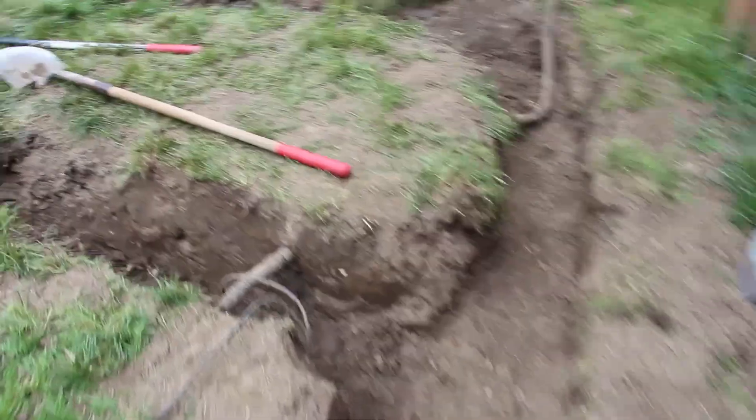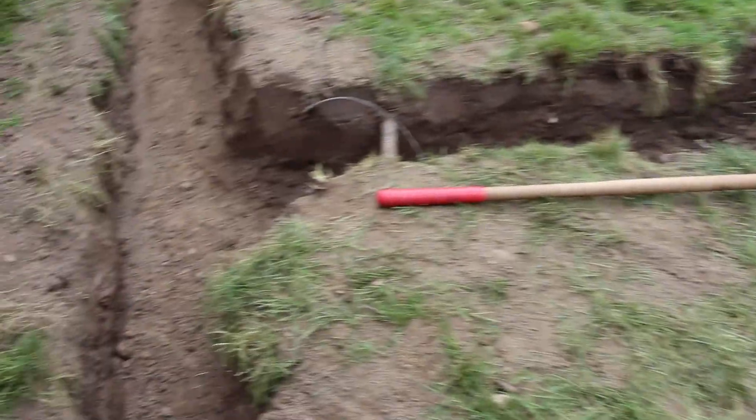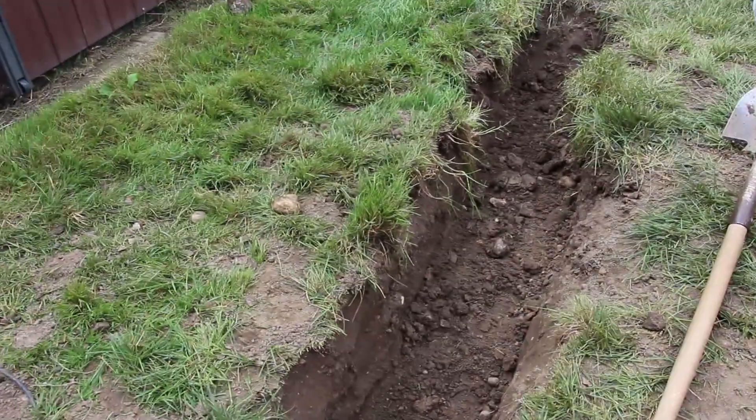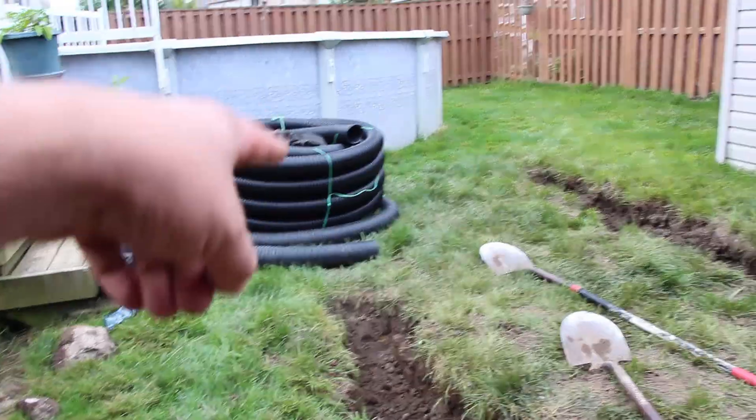We're 16 inches down, all the way down to about 18 to 20 inches in the deep end. So this is the bad spot — this is where a lot of rain is pooling. We want to be low enough that we're going to capture that, and I wanted a wide enough trench here because this is the problem spot. I added this one in just to make sure we're taking care of all the water that's going to be coming. We've got a 2% slope all the way down to our pop-up emitter. Now we're going to lay in our fabric, pipe, and we've got gravel delivered, so that'll go in next.